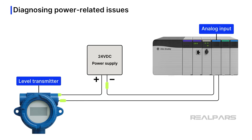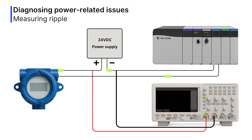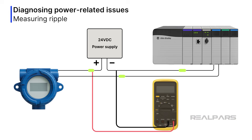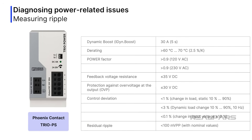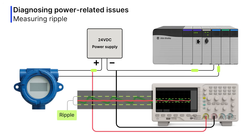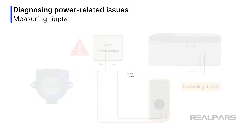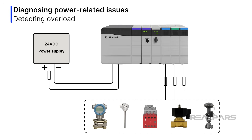We will end this video with a short discussion on diagnosing power-related issues. Erratic equipment behavior, weird signals, and unexplained glitches can be symptoms of power supply issues. An oscilloscope is the best tool for measuring ripple, but it can also be done with a digital multimeter or DMM. The Phoenix Contact Trio PS states a residual ripple value of less than 100 millivolts peak to peak. Because a ripple voltage looks more like a sawtooth than a sine wave, the DMM may have a problem because it measures RMS voltages. Nevertheless, the DMM can be connected to measure AC volts across the 24-volt DC output terminals — any reading exceeding 35 millivolts RMS indicates the power supply's specifications are breached. Measuring the power supply current to detect an overload condition is a simple solution, but not very practical unless you have a clamp-on style meter.